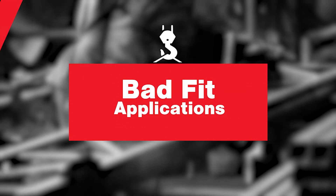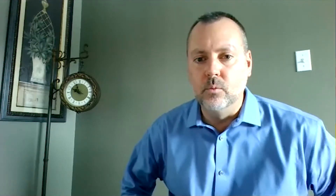These hoists have capacity ranges from 1/8 ton up to 1 ton. Not everything works great everywhere — saltwater environments can be caustic, and explosive environments require specific engineering. Even though these hoists have been placed in many industrial applications and are IP55 rated, meaning they can handle certain degrees of dust and water and are indoor and outdoor rated, the biggest limitation is capacity. Anything over 1 ton, we have to switch over to our NER hoists. But 1 ton and down, these are great fits.